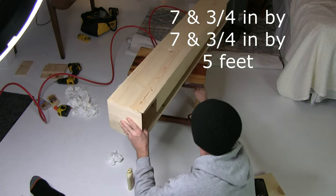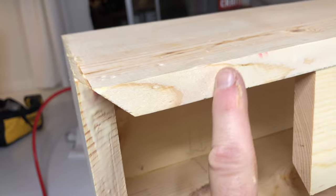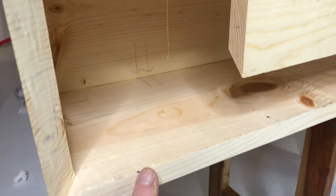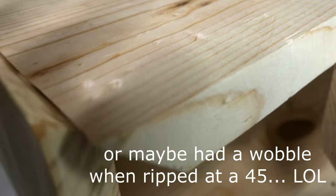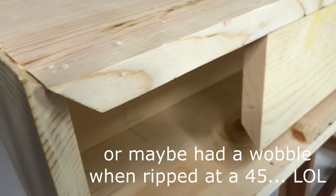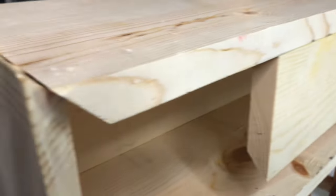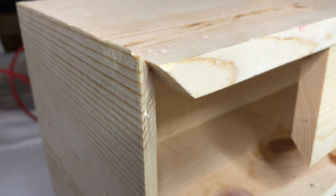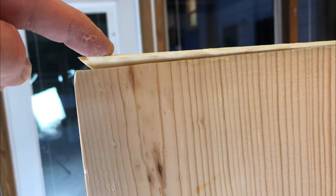Let's see if you can see it better this way. So you can see how we're off. So this piece of wood is bowed. You know, of course, we might not have nailed it on perfectly straight. So it sounds easy to do, but you know, working with these 2x4s with this wood isn't the easiest. So we're gonna stand this piece of wood up and pull it apart and then brad nail this end piece on. So I need to take this top piece and push it down if I can,